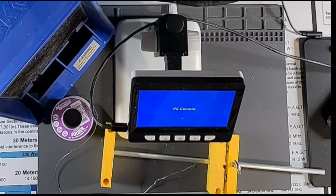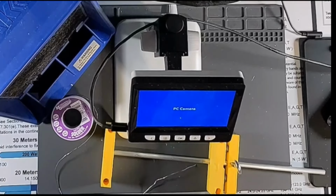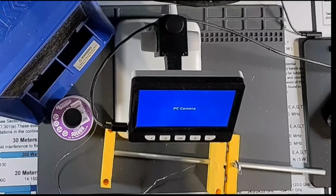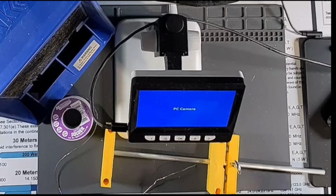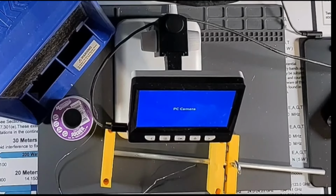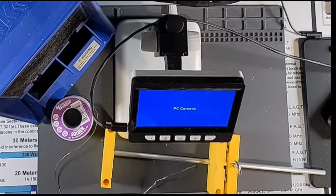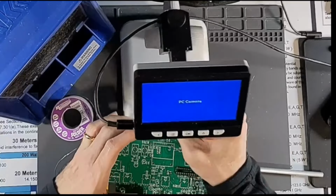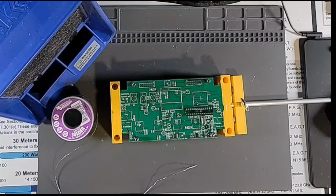And he mentions in the instructions that these pins can short out against the toroids on the bottom board when you assemble it, if you're not careful. So I'm going to forge ahead, but before I assemble this bottom board, I'm going to get some new clippers to make sure this top board is well trimmed.